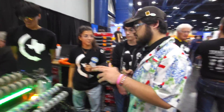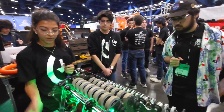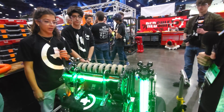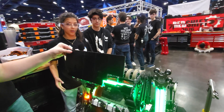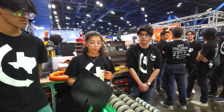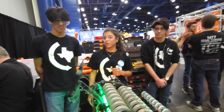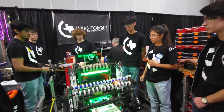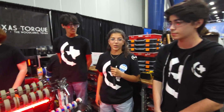It seems like you guys have a special amp mechanism right here. Talk to me more about that. So this year at the beginning of the season, we thought we had an amp mechanism. We based our geometry off the amp because we figured out the best angle to shoot from and we built our shooter around that. But then we realized that the variation between the hardness of the notes made it so that our set point didn't work. So we came up with this amp ramp where we shoot the piece straight up and it falls onto the ramp and into the amp. We've been able to successfully slide our notes right into the amp.